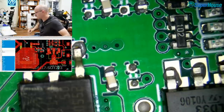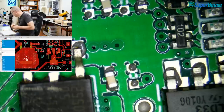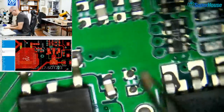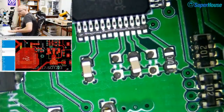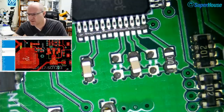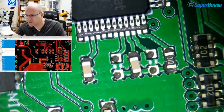So I originally had the vacuum nozzle set up so that when it was placing a part, it would just isolate the nozzle from vacuum, so it was no longer positively pulling it onto the nozzle. And I then changed it so that I've got a blow-off positive pressure, but you need to make sure it's only a small amount of positive pressure, because the problem is that otherwise it can basically be like a little high pressure air jet.